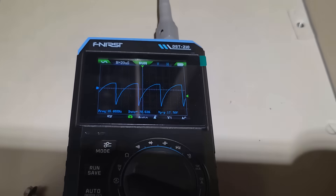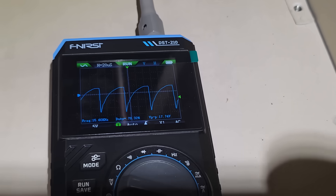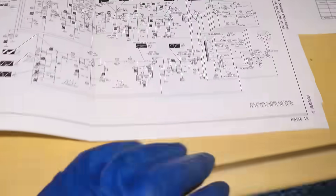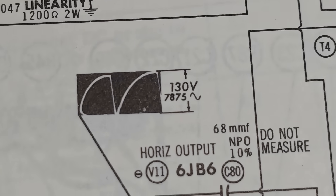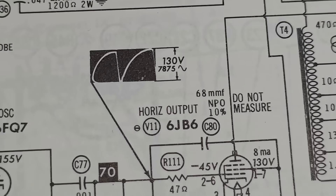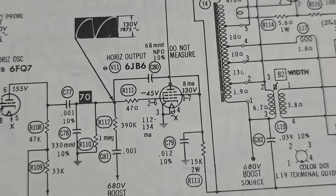It has a dim raster. That's a dim raster — kind of looks like the CRT is pretty tired. That's not under normal light; it's dim. The camera makes it look a lot brighter than it is. So we wanted 130 volts peak-to-peak, which we're over, according to the reading, but I didn't calibrate it. Let's check the DC voltage.